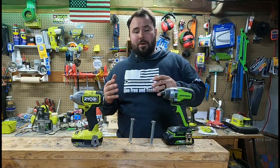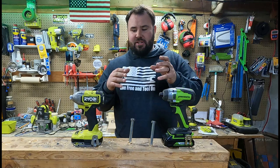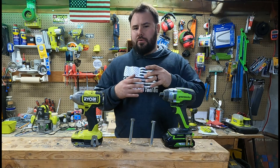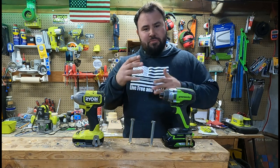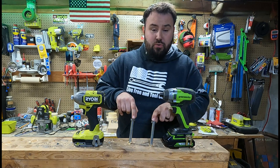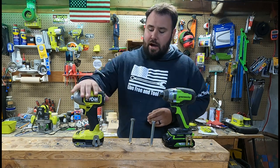That was an incredible test — in fact, so much so that I actually had to go back and review the video to see which one came in first. The Ryobi has higher RPMs and the Greenworks has higher torque. On the lower-load tasks that don't take as much power, the Ryobi really came out on top. But when it came to the high-friction items — like those huge half-inch, ten-inch lag screws — the Greenworks drove them faster because it has more power.